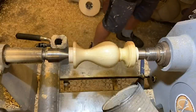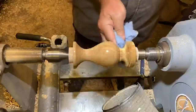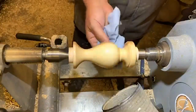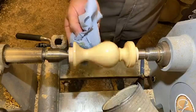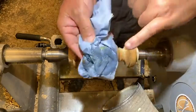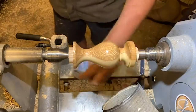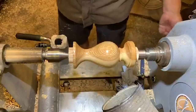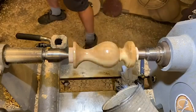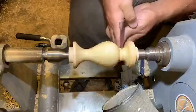There we are. Now I let that oil dry a little bit. That was from Tuesday, and it's been really, really hot in the workshop, so it's a little bit gunky. It doesn't matter, that's the beauty of oil. I'm just going to wipe off a bit of the excess, a bit of the dry scum from the top. So down to low speed and a very light sand with a 600 grit, and I'm going to just blitz through it.